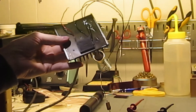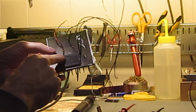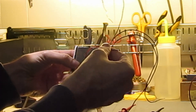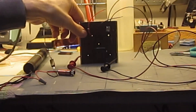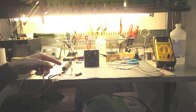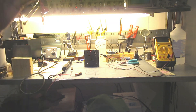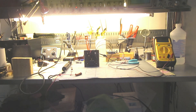So Colin made a YouTube video on this. It's a Peltier sensor that has really thin copper wire thermal-glued to the front and then spray-painted with black ceramic spray paint. You can put current through it to heat it up with a known amount of power, then shine a laser on it, get a voltage signal off the Peltier junction, and calibrate the laser that way.